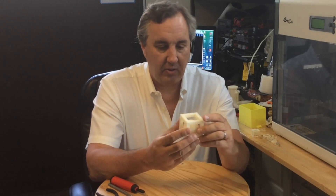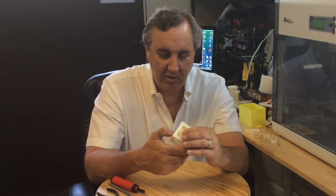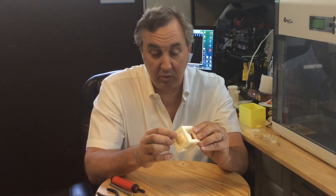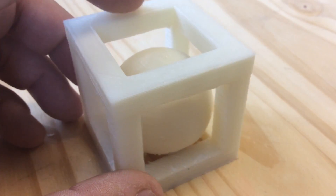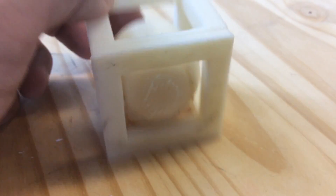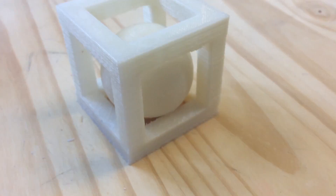When you set it down it looks pretty good, until you pick it up and see the pits in the ball — and it's really only on one side. The other side isn't quite as good as the top but it's a lot better than that one side. So there's definitely some pitting. The box itself looks really good — it's pretty smooth because of the supports, no sagging. Overall this came out pretty good. I'm pleased with the way the overall print went except for that melting at the bottom. Looking at the close-up, the ball and box look really good until you tip it up and see the bad part on the bottom — that's the extruder getting too hot down at that level, which is about the same level as the bottom of the box.